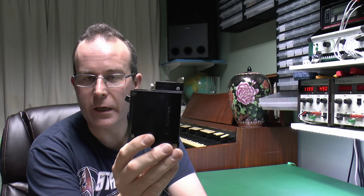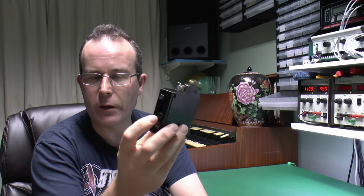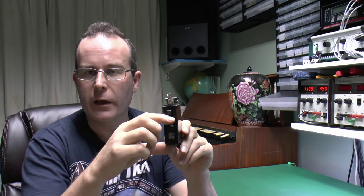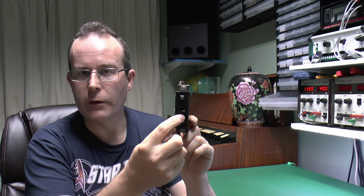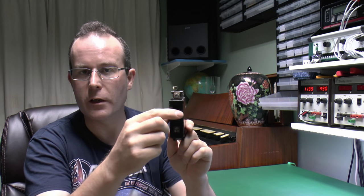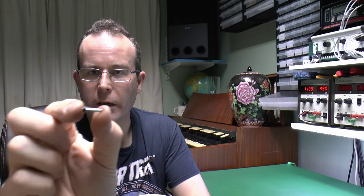So that's a couple of six-amp circuit breakers from Czechoslovakia, or at least made there when it was still called that. I'll do another video on these later outside to actually get them to trip and see the little button indicator protrude and how the resetting mechanism works. The wiring left in them is actually aluminium — shiny silver all the way through and non-magnetic. Aluminium wiring was used in the UK for only a very short period, and virtually all of those installations have long since been replaced with copper. But this is definitely solid aluminium wiring, not tinned copper.